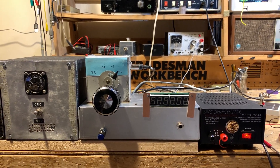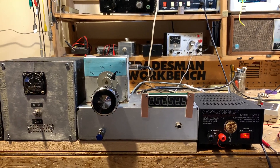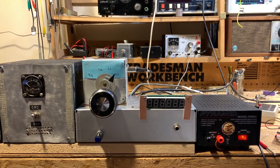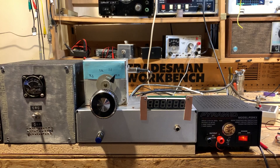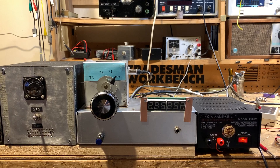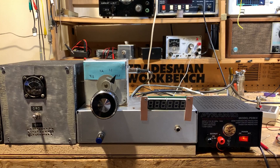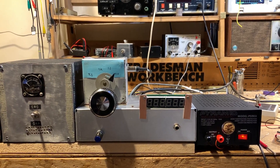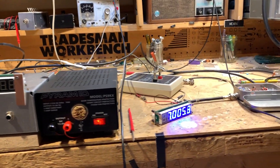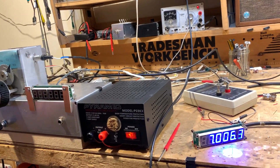So, not wanting to be deterred, I came up with a solution: use an NE602 to shift the VFO frequency to a point where the subtraction from the IF would not result in a negative number, and hopefully by plugging in the right IF frequency into the counter, I would get it to work happily. And look at this — boom! This is a moment of success.